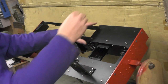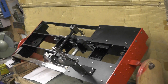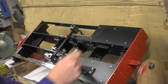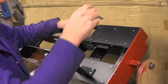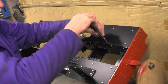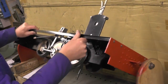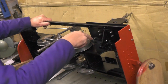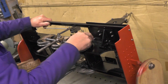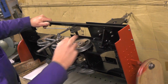You're probably not going to see them anyway because they're inside the cab. I've used six M3 screws on each side, because I've actually threaded the angle with an M3 thread. But just to be sure that nothing's going to vibrate loose, I am putting a nut on and a washer - I've done it on this side already. And I'm just going to get my Dremel and cut off any excess screw that's sticking out once I've got my nuts fitted.